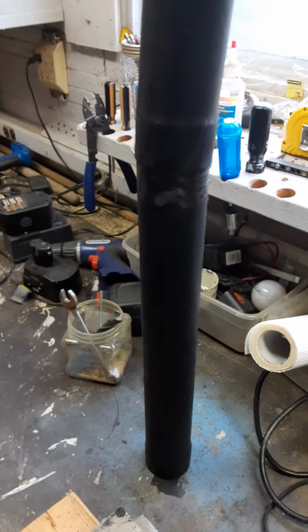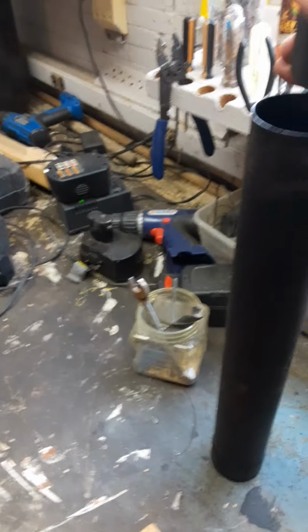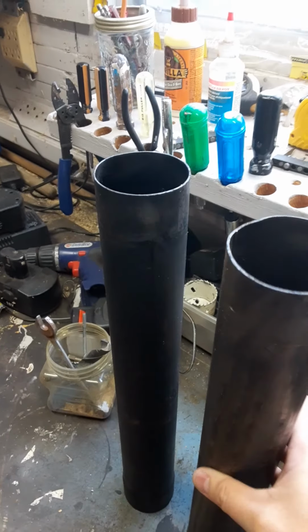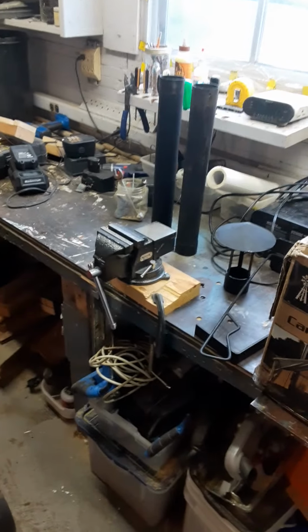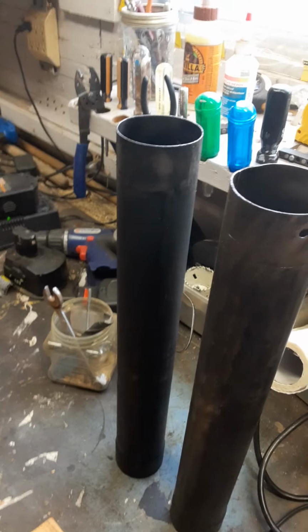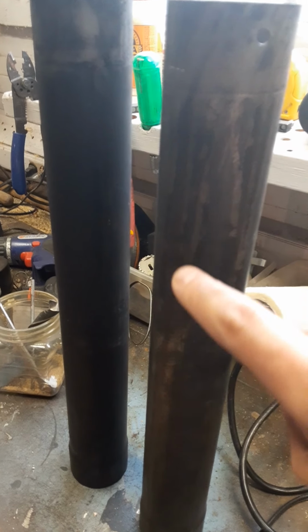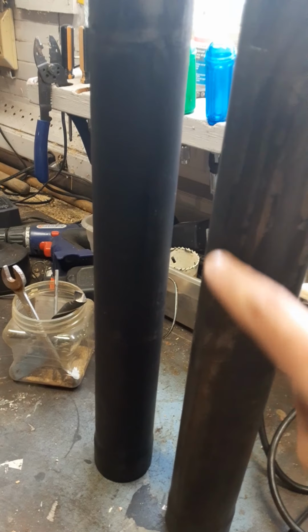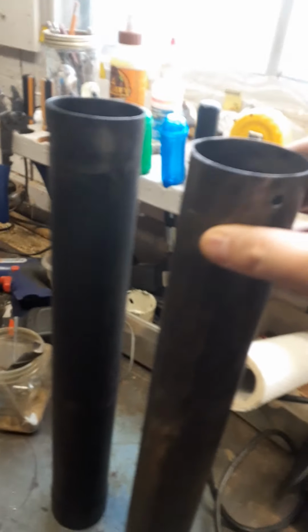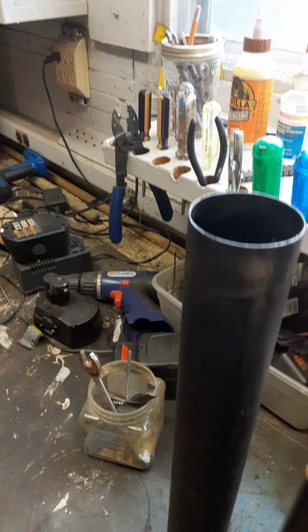I don't know if you guys can see that, but the tubes stack on top of each other, which is all well and great. But the problem is that when they stack on top of each other like that, when you're burning wood like pine and fir and those types of woods, you have creosote. Well, the creosote gets hot, and it's inside these tubes. You might be able to see that. As you can see, there's some right here. That's the creosote, where it's run down from where these are linked together. It's run down, and you have hot creosote running on the outside of your chimney pipes.